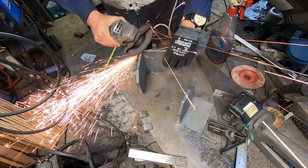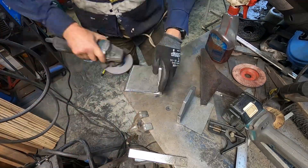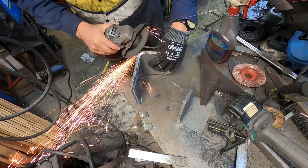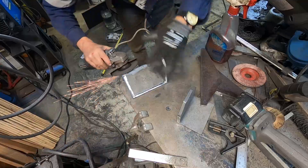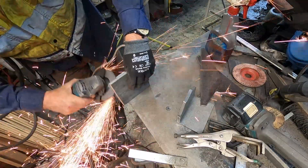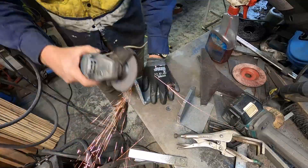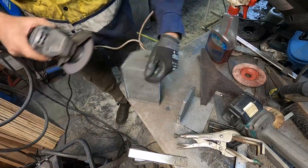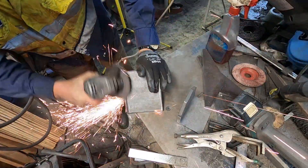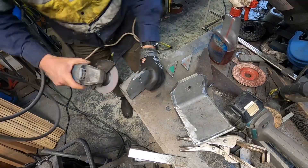You'll see a lot of grinding in these clips, which I've sped up. The grinding is primarily to get a V-groove going so that the welds can actually penetrate all the way through the 10mm from both sides. I put the V-grooves in so I could grind off the weld flat and seamless — I didn't want to see where the welds were as they could potentially interfere with the flatness of the chassis. I'm also trying to take about 10mm off the flats to get rid of the galvanized coating, because galvanizing and welding just does not work — it causes a lot of hissing, the fumes are not good for you, and the weld won't be as strong.